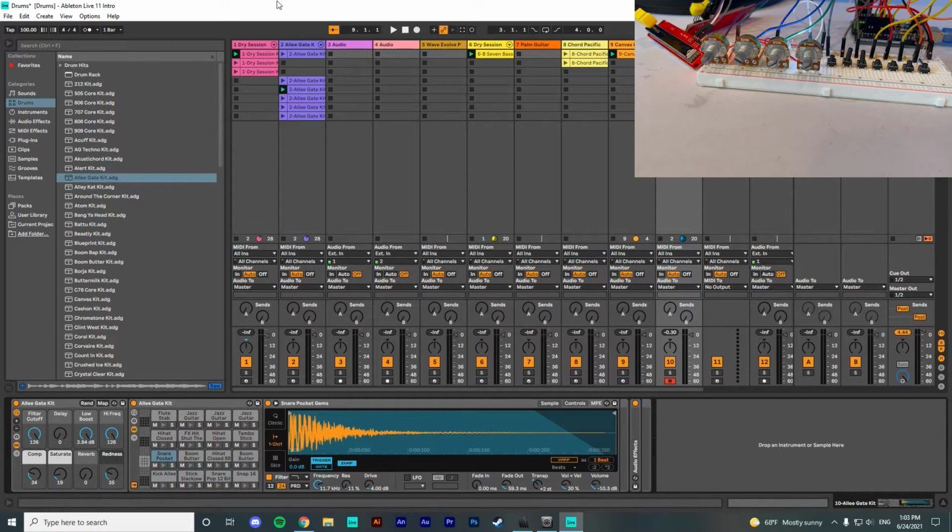The next step was mapping the buttons to sounds in the DAW. It was tedious at first because the buttons were not automatically mapped to audible notes, and instead mapped to this octave at the very bottom. So by changing the code a little bit, I could make it automatically mapped to notes in the program. It just started notes 2 octaves higher than normal, making the notes actually audible.